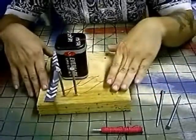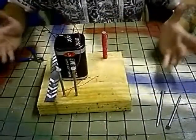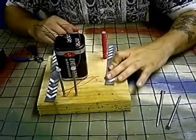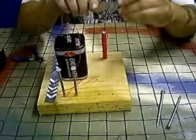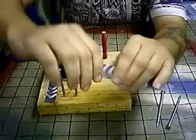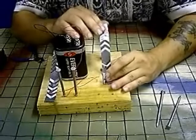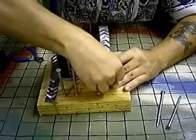Now we want to build the receiving end of this station right here. I already have my nail and it just drops in here — that's the easy part. The next part is I need to put this piece on as my sounder. This sounder doesn't get hooked up to any electricity; it just has to be attracted to the nail whenever I get a signal into this coil. So I'm going to bend this part up at a 90 degree angle, and then over here on this side I'm going to bend this down so that it makes an S shape and I can get it pretty close to my nail. Then I'm going to nail it down.